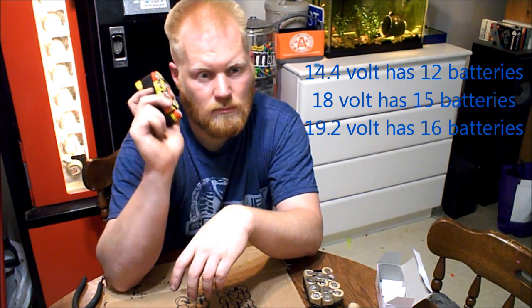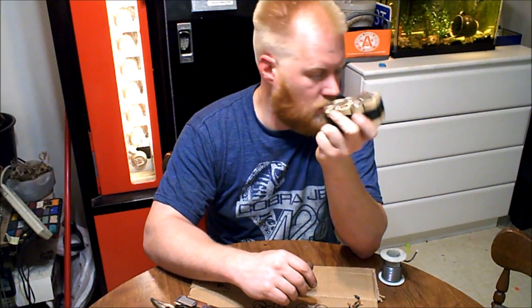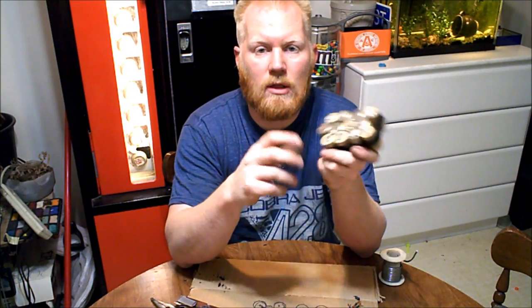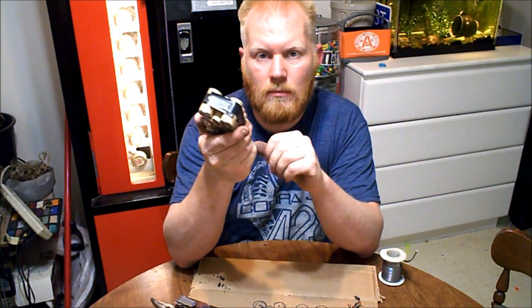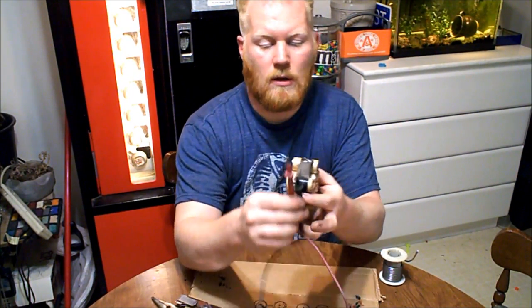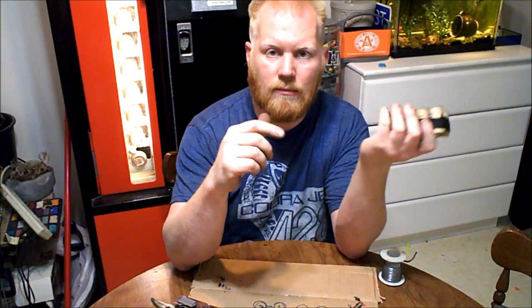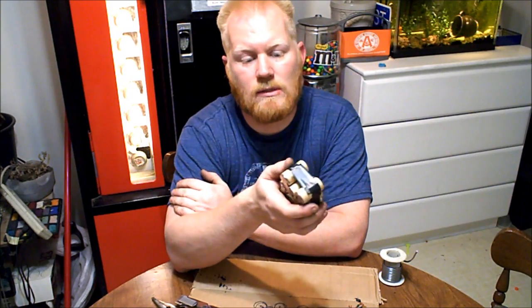Remember: don't throw away your old battery packs. Not all the batteries are bad — usually only one, two, or maybe three cells are actually the culprits. Take them out, test each one individually with your multimeter on each side. The good ones you can cut out and set aside; the bad ones throw away. If you haven't already, click the subscribe button, leave a comment below — see you guys soon!